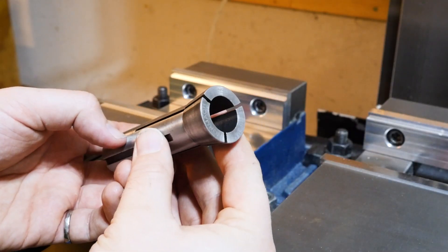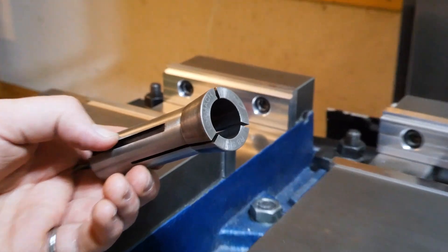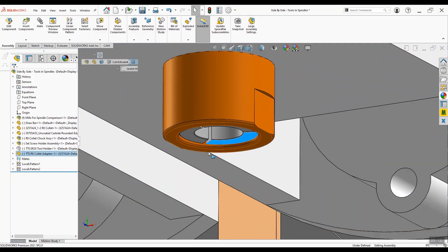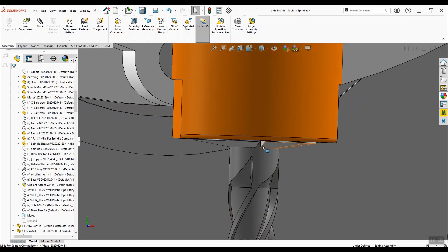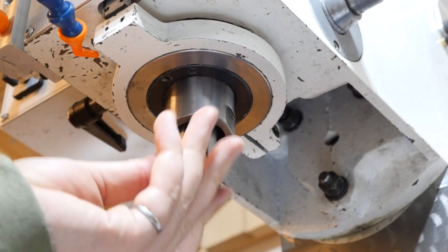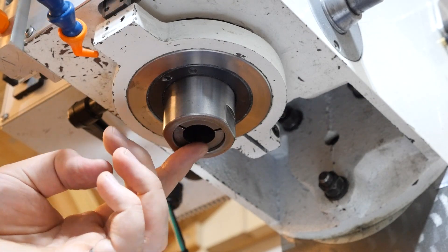The adapter looks like a three-quarter inch spring collet, but it isn't. If you look a little closer, it has a flat face that sits above the surface of the spindle nose, unlike regular collets that stick out past the spindle face. But once this adapter's in the mill, it stays there, and you'll gain the ability to use every single TTS tool on your mill.